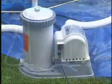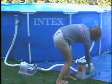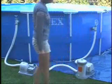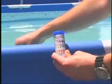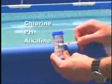Since your filter pump is a standalone unit, it is independently powered from the chlorine generator. You should turn off the filter pump after each chlorination cycle is complete. But if necessary, you can continue to run the pump after the cycle ends. Just make sure to turn the pump back on before the next chlorination cycle starts. As with any chlorination system, the right balance of pool chemistry is very important. The Intex three-way test strips provided with your generator will help you maintain the proper water balance.